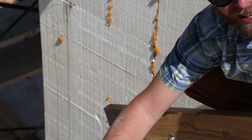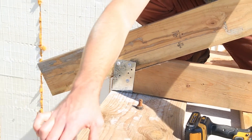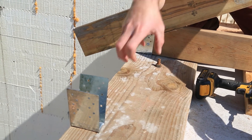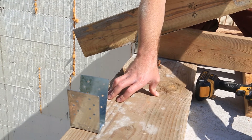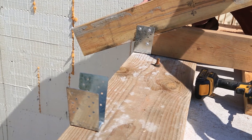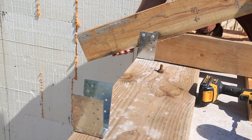As you can see, we're going to take six screws that we're going to drill into the actual top plate, and that gives us a very firm connection. This is also designed with a little plate that digs in and gives it a really firm spot to mold onto the top plate. From there I'm going to put four screws into each side of this bracket, giving me a really strong connection on either side so these are not going to come apart.